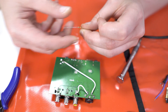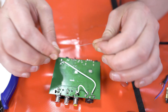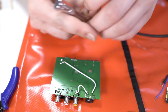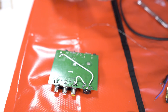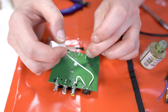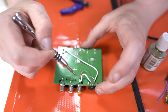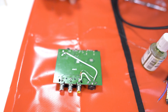We're almost done — from here the thing actually works and you don't have any static, but the picture is really dark. So what I'm going to do is use this resistor. This is a 33-ohm resistor. I tried a 64 or 65-ohm and it didn't do any better, so we're going to use this one. We're going to put it between this pin here and this pin here, and this is going to make the picture a lot brighter. Let me just snip these legs off and flux up the resistor. Ideally you'd use a bit of wire in between.